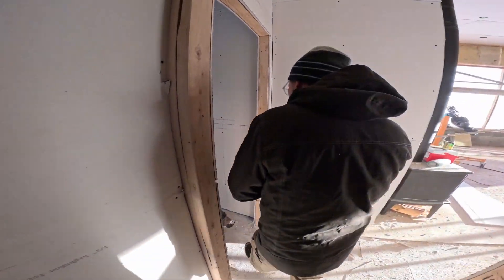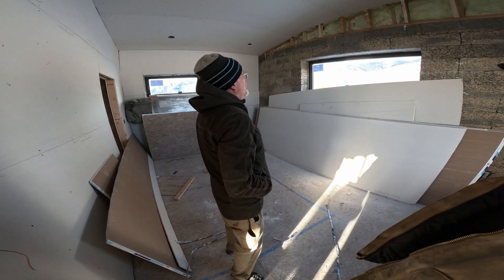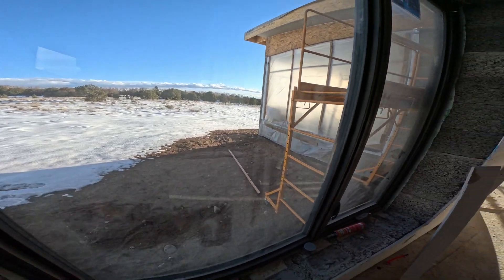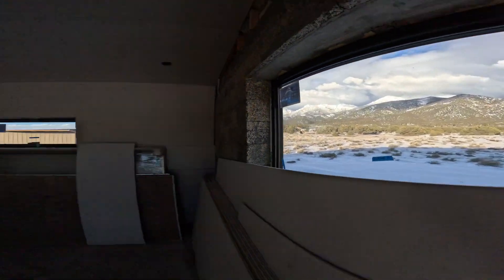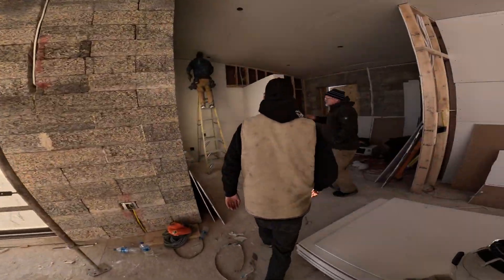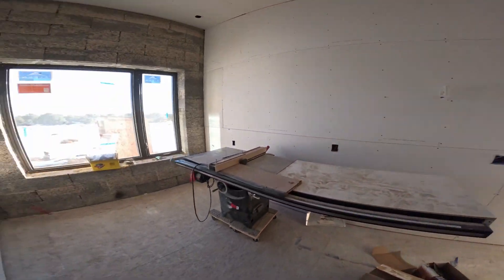This is the main bedroom — that's an egress window and aqua board over here. For cutting the block for electrical conduit, I used a seven-inch grinder with a concrete cutting diamond abrasive wheel. To penetrate the walls you just pick the right spot to avoid the vertical column of concrete — you can get through the wood portion, about two inches of clearance.